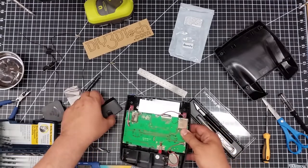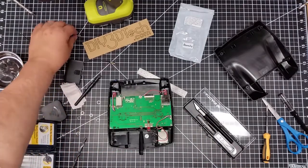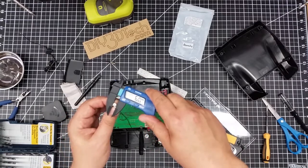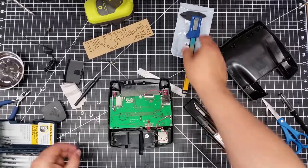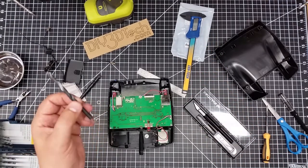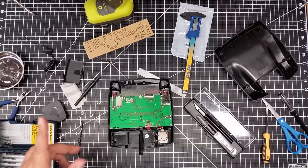To drill this out, I'm going to be using a smaller drill to pilot it first. I've measured these at about six millimeters — they are exactly six millimeters. So I'm going to use a 15/64th drill bit, which is about 5.75 to 5.8 millimeters, because I want a really tight fit with these. I may have to ream it out a little bit, but that's okay.